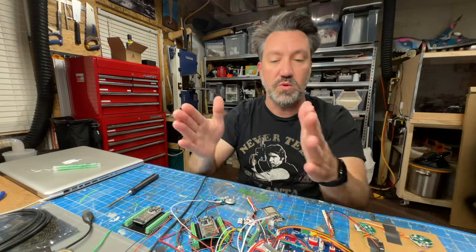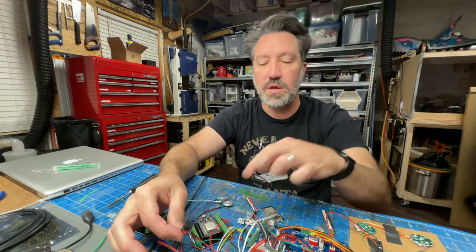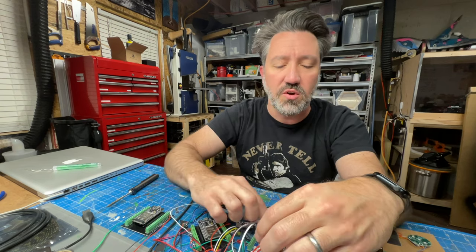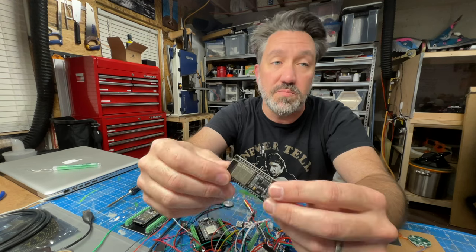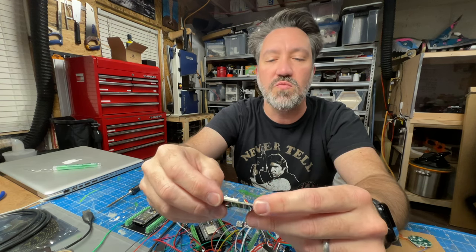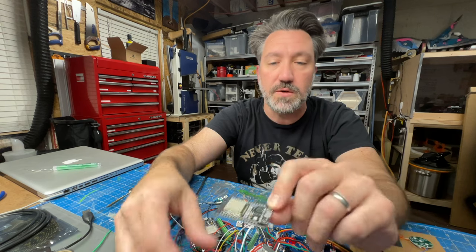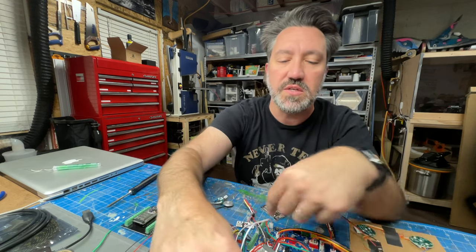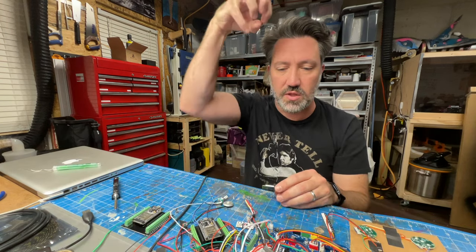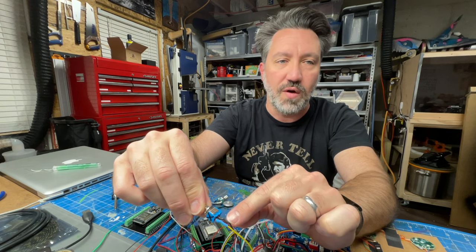We very quickly whittle down the available pins — the piezo buzzer, the vibration motor, everything starts adding up. We have to get creative. Some pins on this board are input-only despite being labeled GPIO. Another wrinkle: some pins we need don't have a built-in pull-up resistor. On the Arduino there's a built-in pull-up — think of it like a spring that pulls the pin high or low by default. When you flip the switch and connect the pin to ground, you pull it low and know the state.